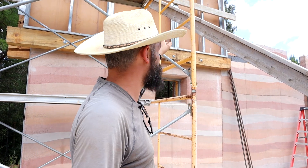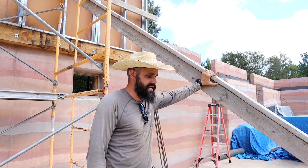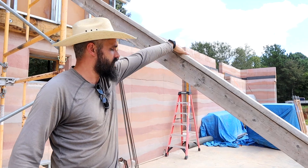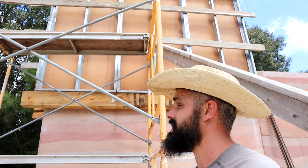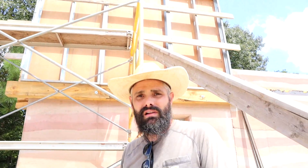The other issue we ran into was getting the formwork to fit flush up against the existing wall without bowing out slightly. Right now there's about an eighth-inch gap between the existing wall and the form as it comes up because we just can't push it in tight enough. We're so tall that our turnbuckles have to be so long that the wood is actually beginning to bend and warp. So we nailed two boards together for our length, then nailed a board on top crossways to make a T-section, which helps it not bow as much, but it's still bowing pretty significantly — pushing up against the form to push against the existing wall. We also put strong backs every two feet because we don't have turnbuckles and can't get them up that high.